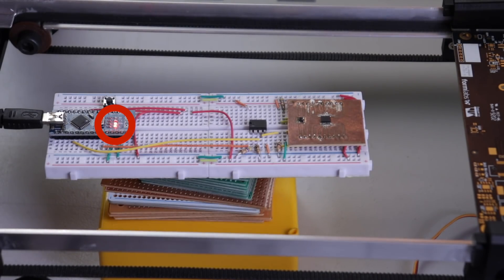The reflective sensor did not do well in literally every metric I was looking for. Not only did opening and closing my curtain change whether it triggered, but even with my finger over it it would flutter, and the board itself still didn't do a very good job. I also tested the difference between the gold reflectivity of the panel and the glossy black solder mask — huge discrepancy. And because the sensor is so small, if it catches a through-hole, mounting hole, or slot it sees no panel at all. It's just not meant for this.